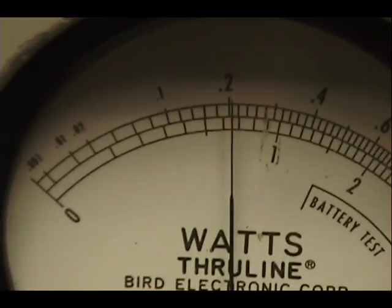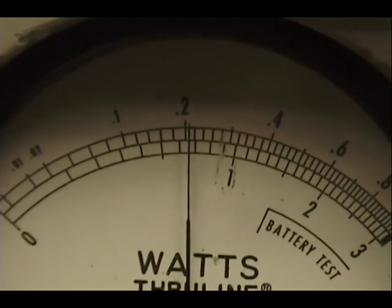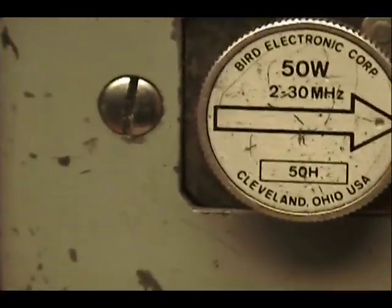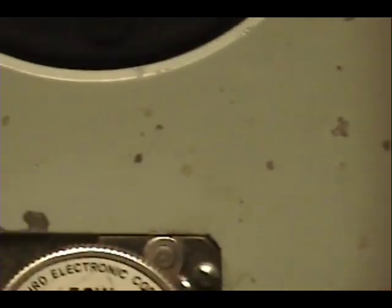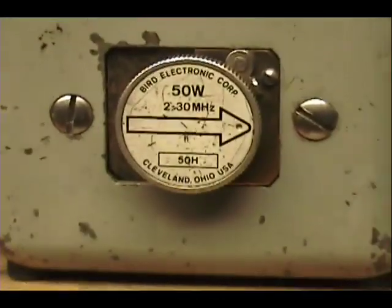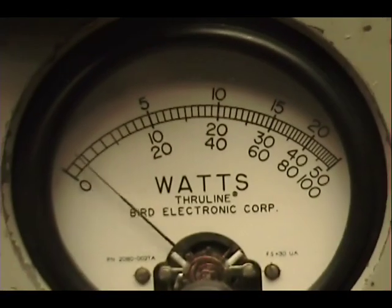Look at that — couldn't get much better. When I wanted two watts, I said it was going to come pretty close to that. As soon as I replaced the MOSFET, usually I've got to do some work to jack it up to four or five watts. But he wanted two anyway, so this made it easy for me.